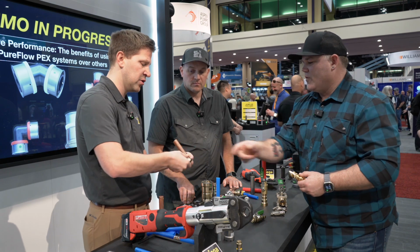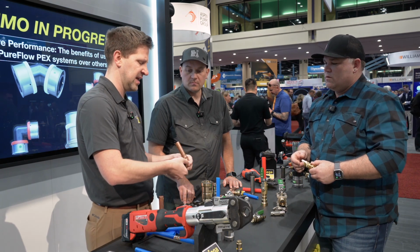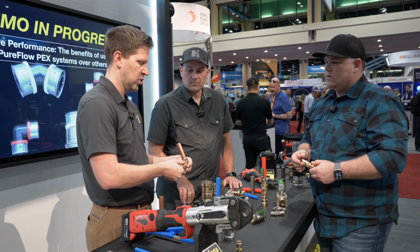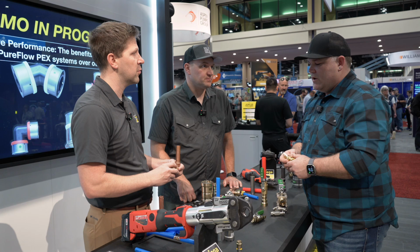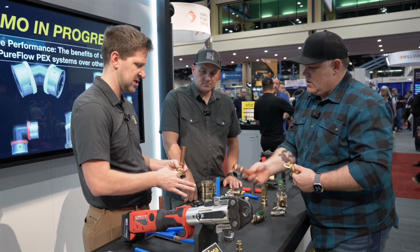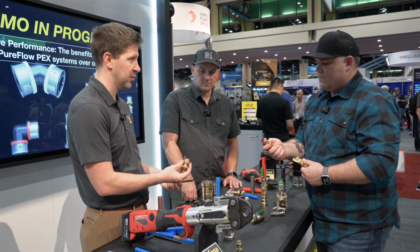This valve is removable. If you don't need that hose connection, you can pull this off and you've got a 1/2 inch MPT, and like I said, you can attach a test gauge, test rig, whatever you need to have your typical connection. So there's your 1/2 inch right there. And then again, you just spin that off to pull the contour out.